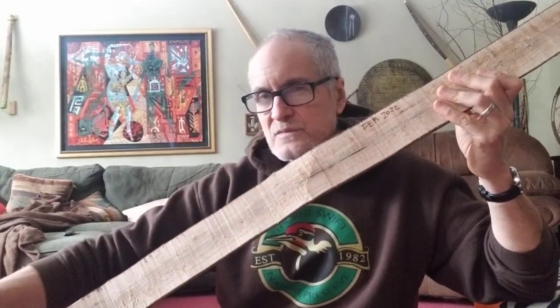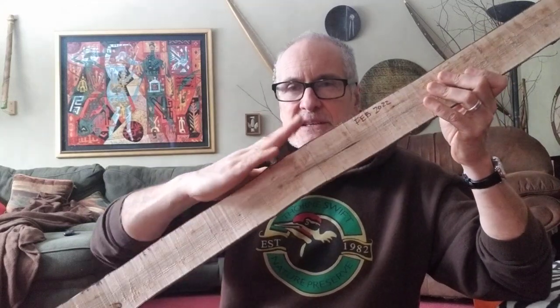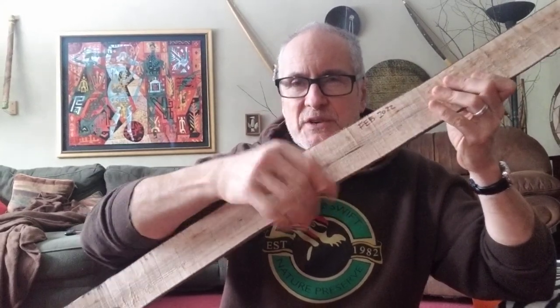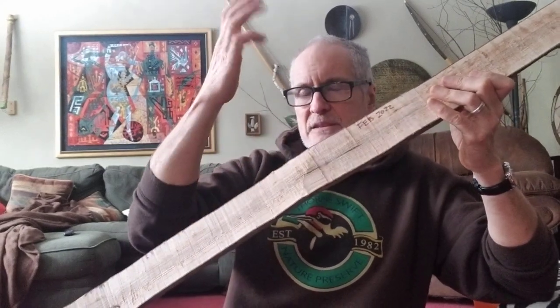What is stopping us? You split it, or you cut it — you figure it out. You scrape it down so you get straight lines through here, so you're not violating any fibers. You're using that center as a guide, so you're not having — picture this — fibers running this way in that plane and also this way. You can have straight lines but still have violations of fibers. Thousands of years ago they were using this for the bow's back.